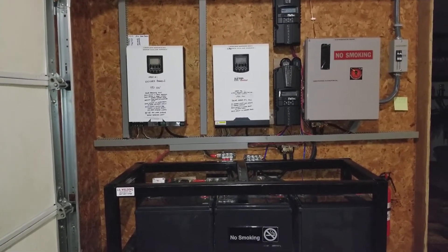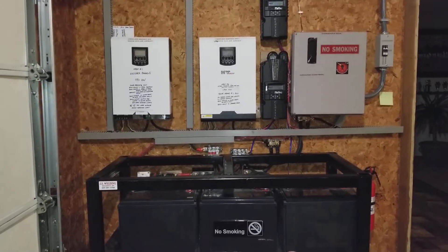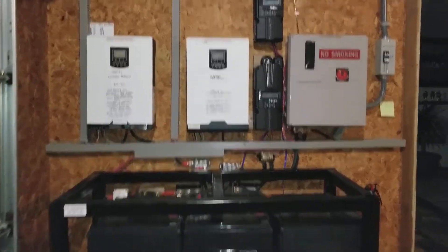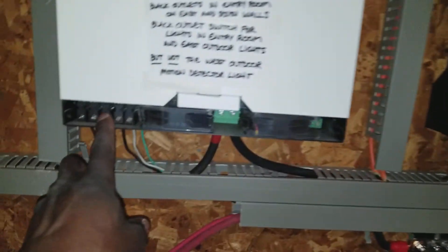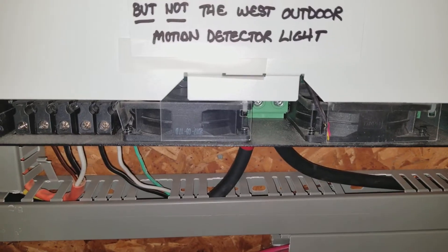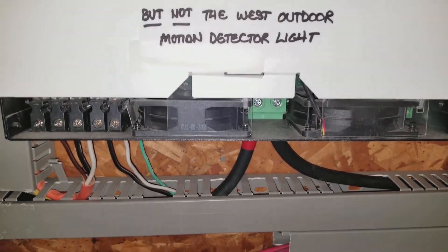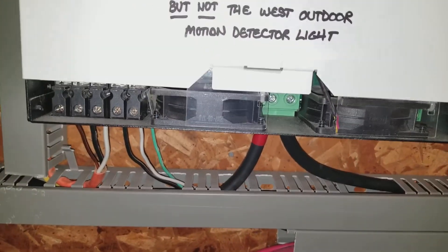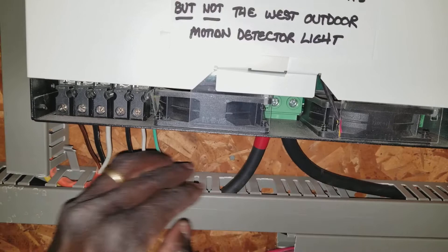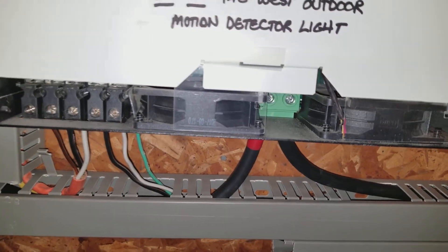I won't be here tomorrow - the homeowner is going to power up everything tomorrow and make sure the AC side is working. All is inverting right now. I need to put this cover back - see, the fans are still really clean. Don't reverse the fans - if you put them backwards it's going to make this device really dirty. It's venting out cool air, not hot air, so look how clean it is after eight months.